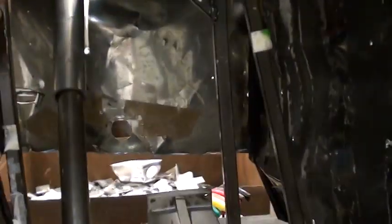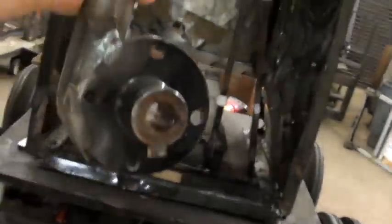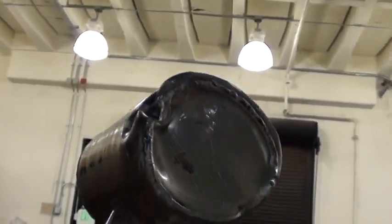We were fighting weight, so we couldn't use one-inch plate in here — it had to be pretty small stuff. This right here is a gearbox from a wheelchair, and this was the hack we had to do after Last Rights blew up our pneumatic cylinder that used to make the hammer swing. Wheelchair gearbox, we ran it at 36 volts. It seemed like it was pretty fast, but not very durable. There was a shaft right there that, on the first hit, just snapped the whole hammer clean off. That's the hit in the hammer head right there — deformed pretty good, but just tore that off. Went flying, made the other team quite happy.